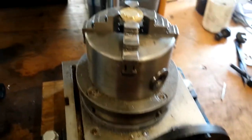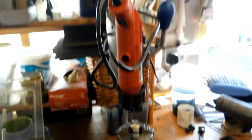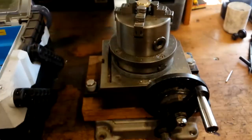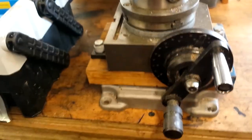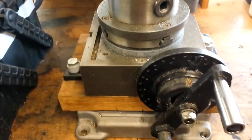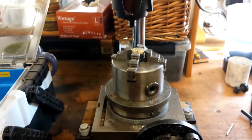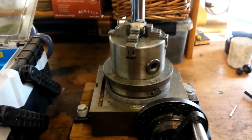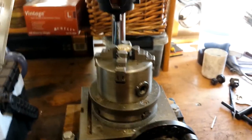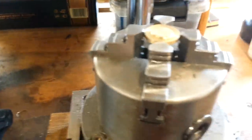For the first operation I'm using a cheap Dremel copy mounted on a stand, and the cylinder cap is held in the four-jaw chuck which is mounted on a rotary table with dividing plate. I'll be able to make three nice equal divisions, which will then transfer onto the cylinder with transfer punches. I'm using tiny M2 screws.